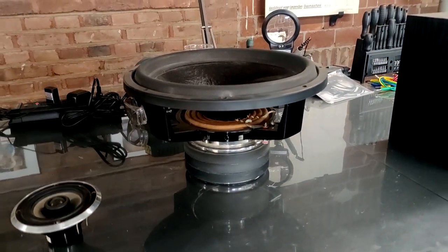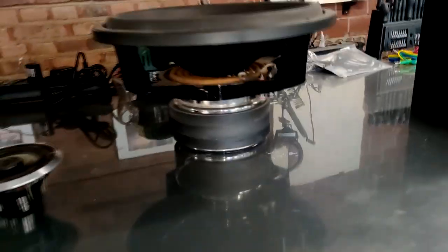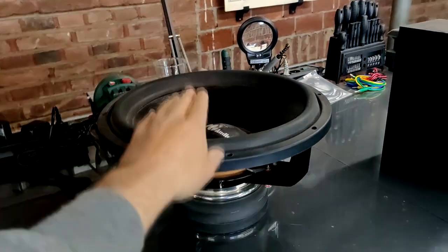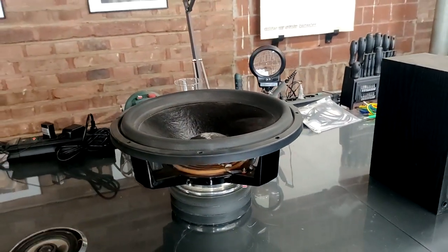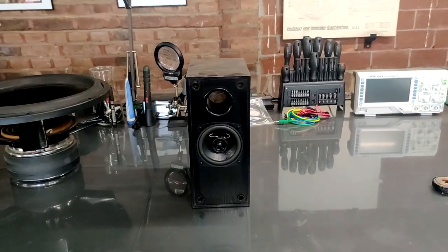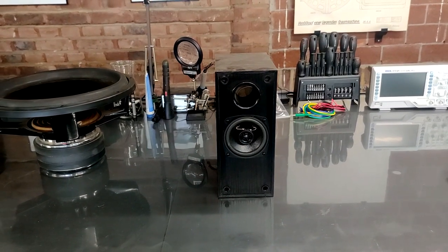Inside of that, there is a coil. And if you apply a voltage to that coil, it's going to create a magnetic field. And that is ultimately moving that membrane that is pushing air molecules basically to your ear, and that's what you hear as sound. These will come in some kind of an enclosure in all ranges, flavors, and varieties.